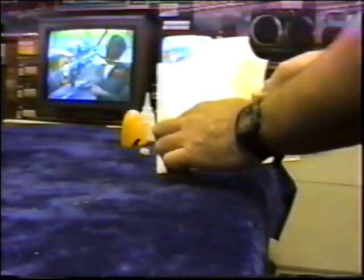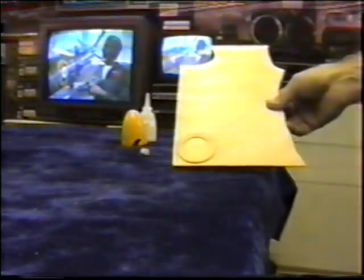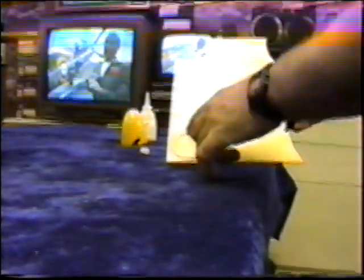Using the first one glued in place and then using the hard edge as a pattern is a good trick no matter any time you're going to do multiples. Always glue the first one to the second one. Don't cut them both out and then try to glue them together symmetrically. Doing it this way is a whole lot easier, and you still want to see that ink line the whole time you're doing it.